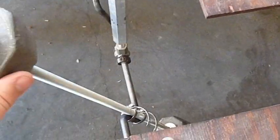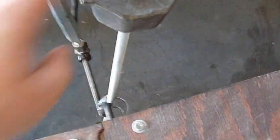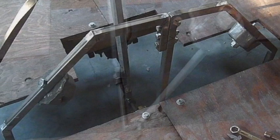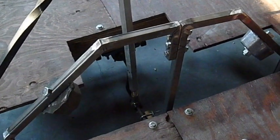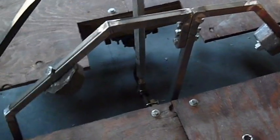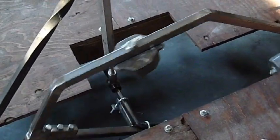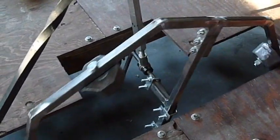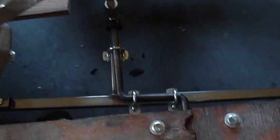So I had to come up with a real flywheel finally — and I also wanted something that looked better, because this is kind of ugly. So here finally is the flywheel I just finished making after thinking about it for quite some time. It is an octagonal ring of three-quarter inch tube stock, welded up, and it then clamps onto the crankshaft with some U-bolts.